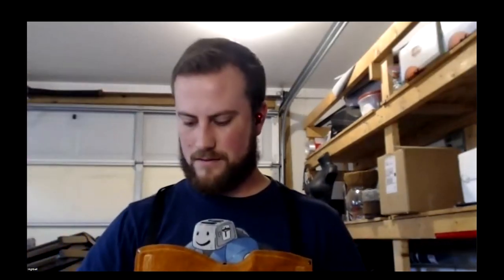Now, let's just talk for a second about why that doesn't need to be in contact with the part. Because we talked earlier about aluminum being different. The oxide layer that coats every particle of aluminum has to be broken before those aluminum particles can join together. That's why it's such a special process commercially.